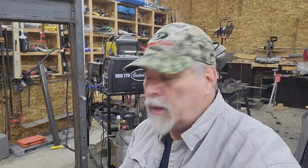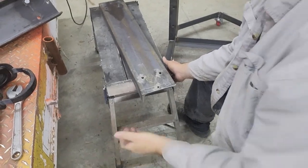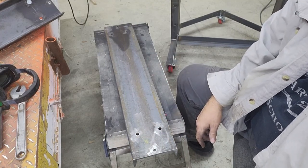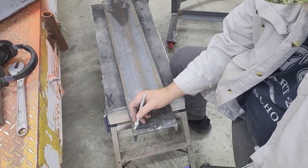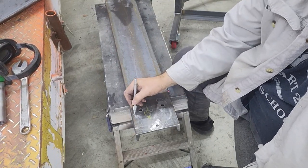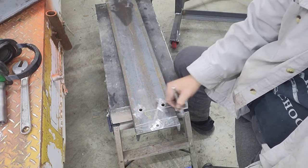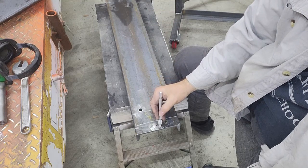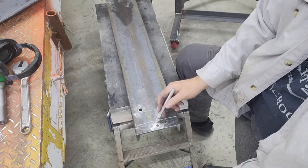I was about ready to do that, and then I decided, I actually had it in the CAD drawing, and I think I'm going to go ahead and stick with that, because if you look down here on the cross table pieces on this one, you can see this got a square cut in, which would work just fine. But in the drawing, I don't know how much you'll be able to see the soapstone mark, but in the drawing, I had this, because the main frames kind of go through this area. So these two cross bolts and separator pins will keep it from moving left to right. And then I'm going to put a smaller 3/4 inch pin out here. The legs shouldn't ever try to spread any, but that would capture them from being able to spread.